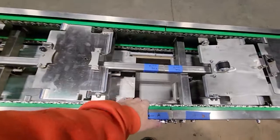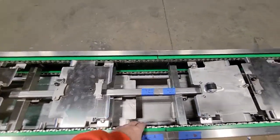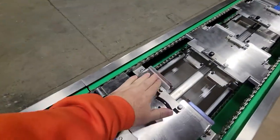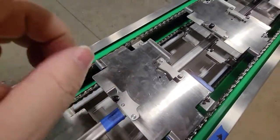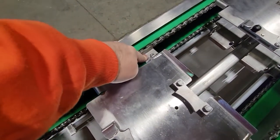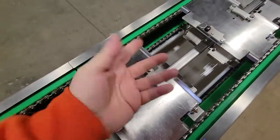The chain will be put in a position so that you guys should put it on. The direction towards upwards, this is right. Okay, this is the way it should be. But I'm going to tell you right now, the way that this chain is installed, my guy messed up. He put it this way. This is wrong. This should be the opposite, and the direction should be like that. So we just have to flip the chain.